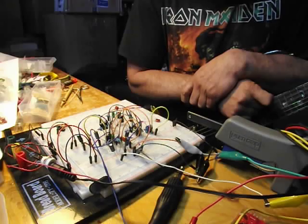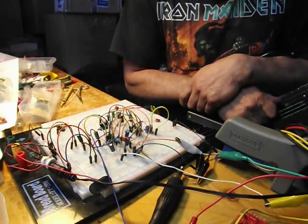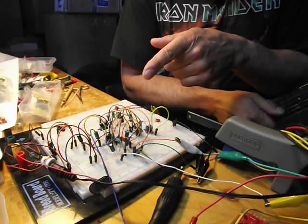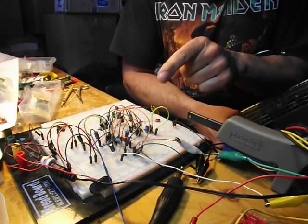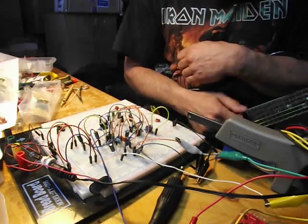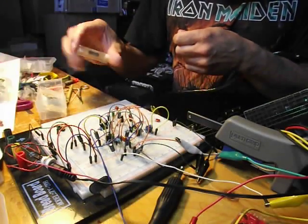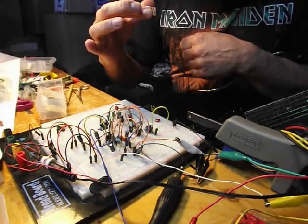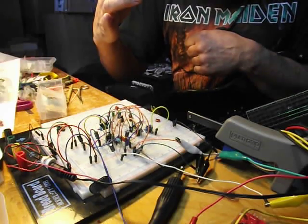You've got all kinds of variants out here. This is basically the Univox Super Fuzz schematic. What I've done here is instead of using six individual transistors, I decided to use four in a one-chip array. And for the Octave section I decided to use a LM394, which is two super matched transistors. So it's basically one chip with four transistors, and this one chip is the equivalent of four 2N2222 transistors. The chip is TPQ2222.